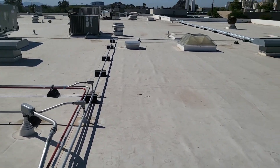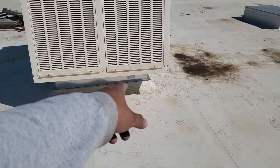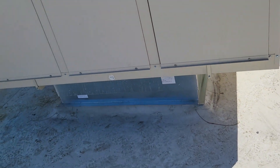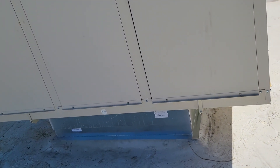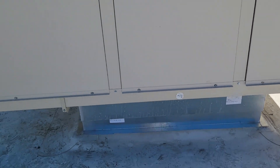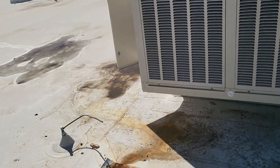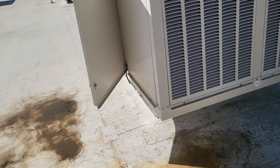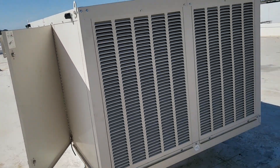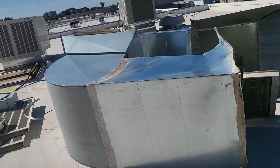Here is the new cooler — you can see we installed it with a new curb underneath. Get a close-up here — there's the new curb. Our roofing portion was excluded, and actually once we let the roofer know, they may not even need anything as far as roofing goes since it swallowed the old curb — we'll let them decide. They are installed and leveled. There's our water line we need to hook up, and we've run out of time for today, so we'll finish up tomorrow. The trailer is also already full.